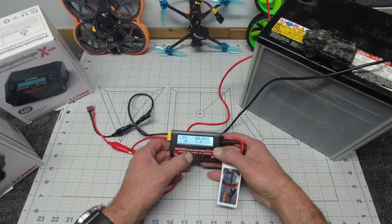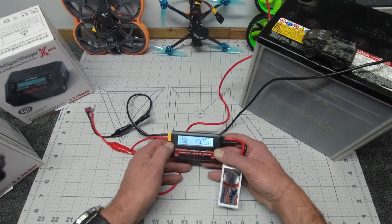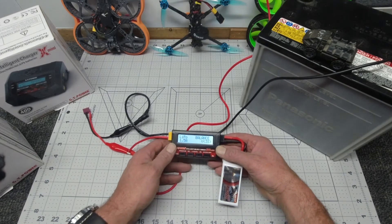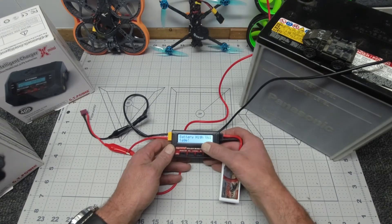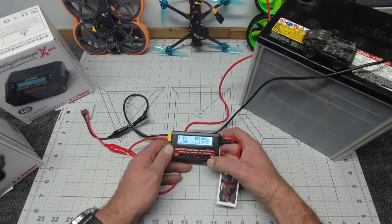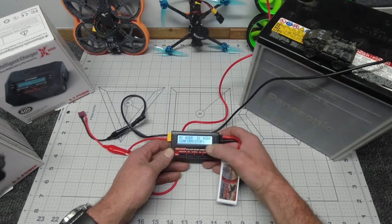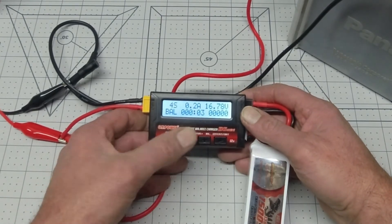Hit enter and let's select our amperage — in this case it's a 1500 milliamp battery, so 1.5 amps charging. Make sure you select 4S. But don't be too concerned if you forget to change this to 4S — if you had it on 3S and go to start it, it will say 'battery voltage high,' which means we've made a mistake, and it won't destroy itself, which is really good. So LiPo balance charge, let's make that 4S. Push start again and then long-press start. It does a battery check and then asks you to confirm once it's tested that everything is set up properly. Hit the enter button again and we are off and charging.